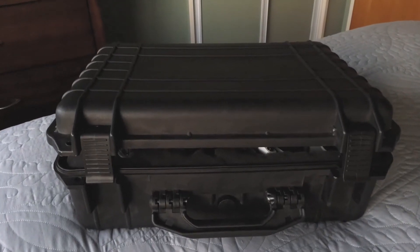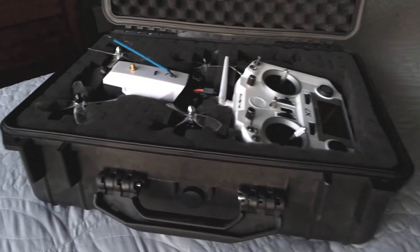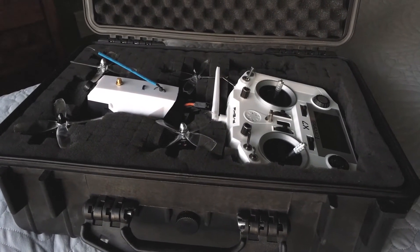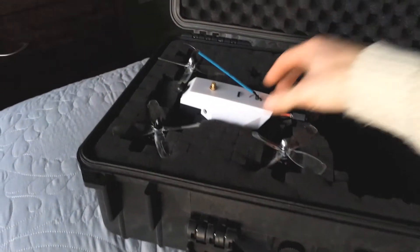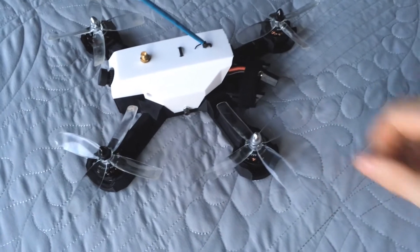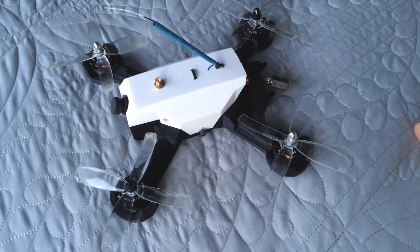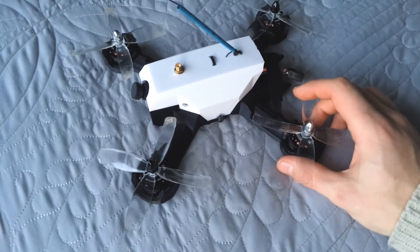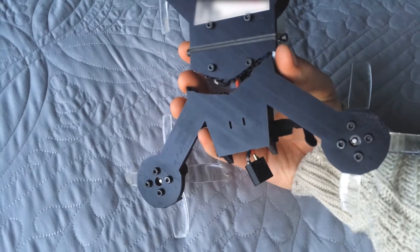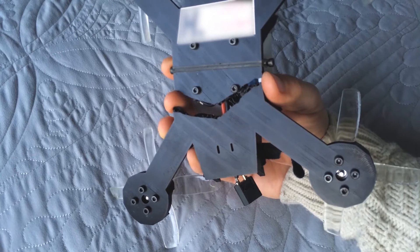I'm going to make a few changes to the design still. Here's a quick analysis of what's going on with the drone. As you saw in that clip, it didn't last long in the air — I think 20 seconds or so. Let me pull this out; I have to be delicate because it is in two pieces. The arms are all intact, which tells me the design of those arms is great — the arm design is suited to 3D printing, there is no weakness around there at all. Where it is weak is where it's cracked here at the back of the frame — so you can see that's not really ideal.